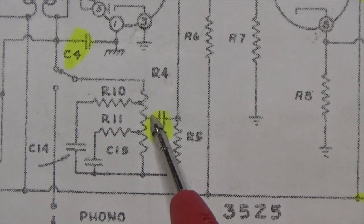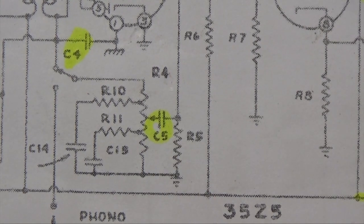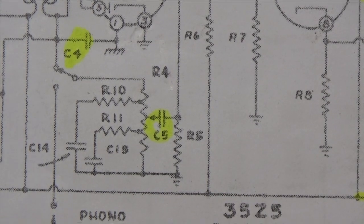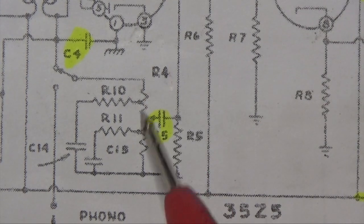So the way that this thing worked originally, it was a 5-terminal volume / on-off switch. And the reason why they did that then was they included a tone stack. So basically when you turned it one way or another, you would basically add more bass. The louder you went, it would add more bass. So there was really no way to control the tone. It was just based on the volume.